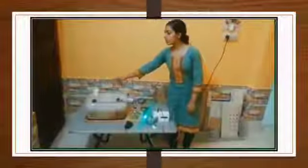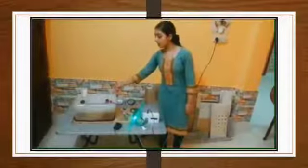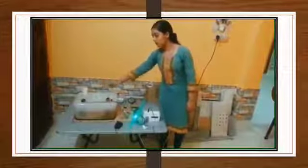There is an outlet from which hydrogen is released. For precautionary measures, we can take a pipe and connect this pipe to the hydrogen outlet so as to disperse the hydrogen to the open space, because hydrogen is inflammable and it can cause serious accidents. Moreover, we can see that the ratio of the oxygen outlet to the hydrogen outlet is 1 to 4. This is to prevent any accidental combustion.